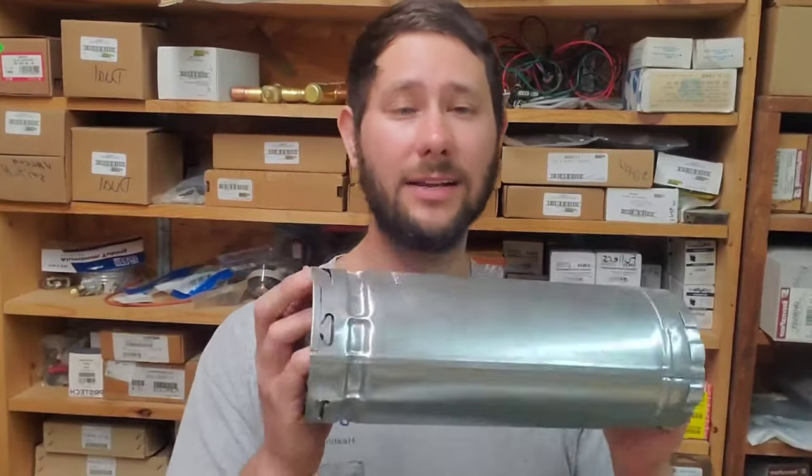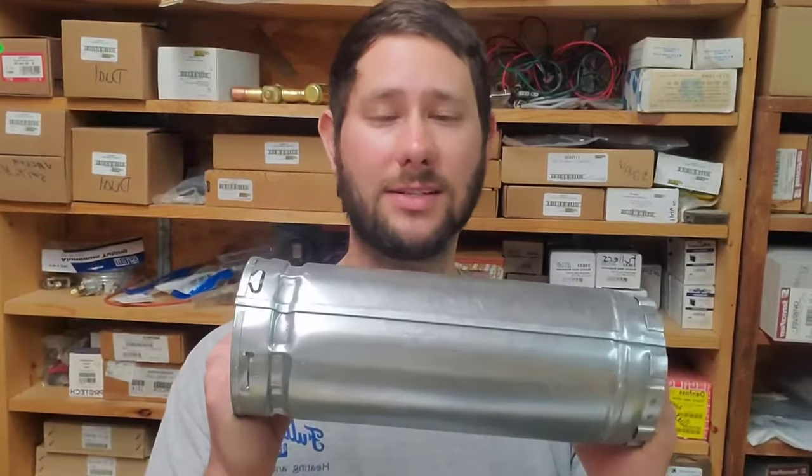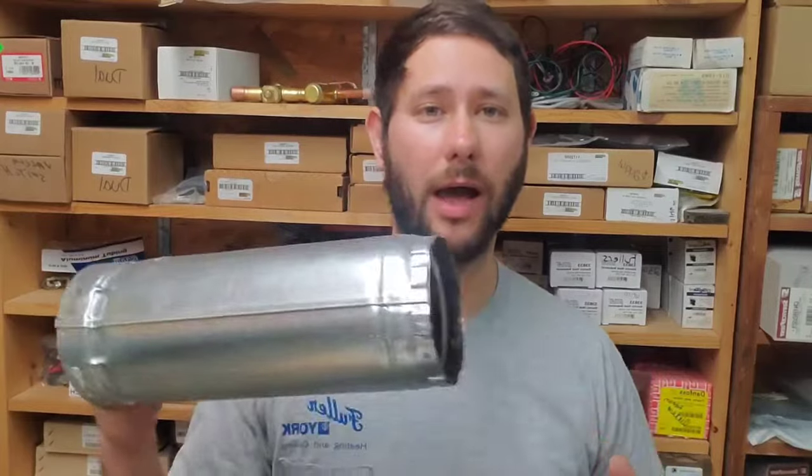When you're outside, you have to use this type of pipe. This is double wall. When you go out and you're underneath the soffit of a house, you've got to run it up past the soffit around 2 feet. And different codes apply for different areas. I might be telling you this, and it might not be the case for you.